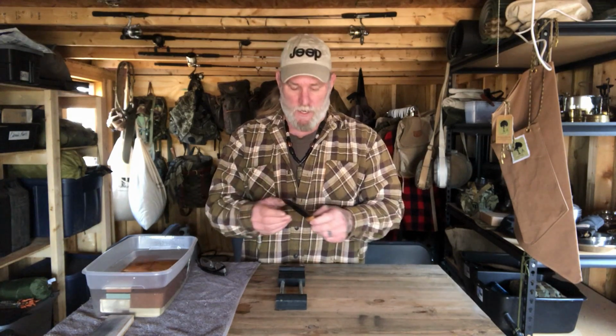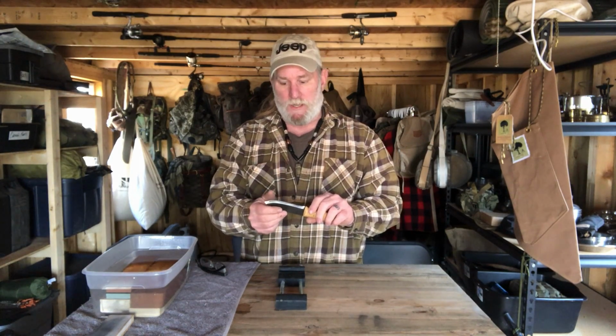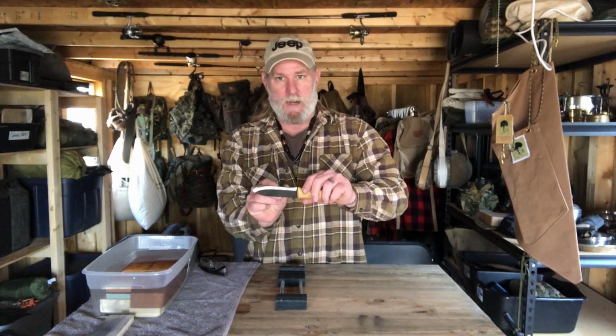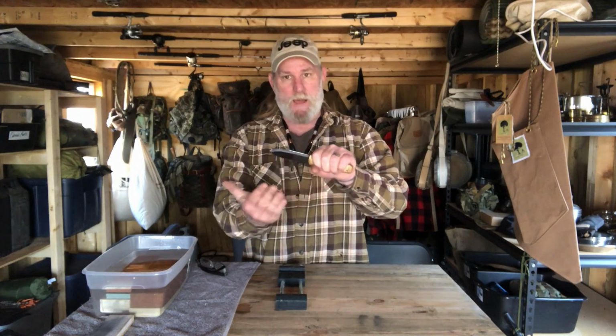It's just not perfect. And what I mean by that is there's an area of the blade about 1 inch wide that I didn't get thin enough during the material reduction process. So when I did the final buffing, it didn't become a razor edge. Most of the blade is shaving sharp, but there's an area right here about 1 inch wide that's not shaving sharp. And so that's going to force me, because I can't go back to the buffer. I can't put this back on a jig to go back to a belt, and the buffer's not enough to remove the material. I'm forced to go to stones.